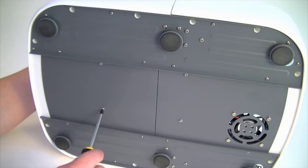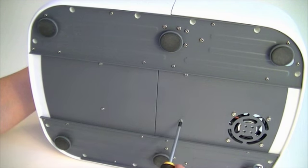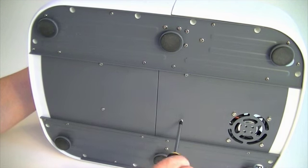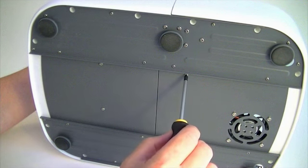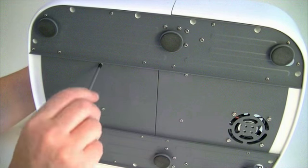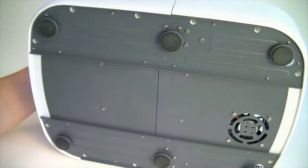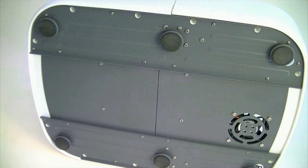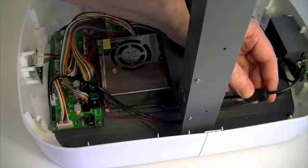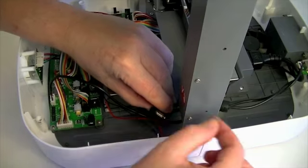Holding the power module firmly in place with one hand, turn the printer onto its side, then fix the power module with 4 bolts from beneath. Connect the jack plug from the power module into the power socket JP9 on the MCU controller board.